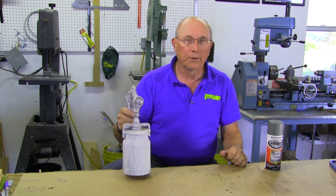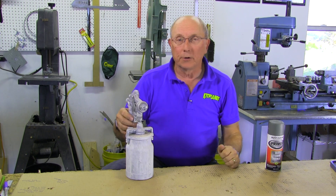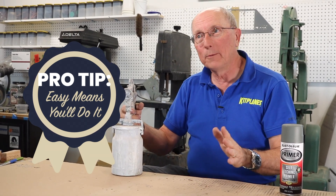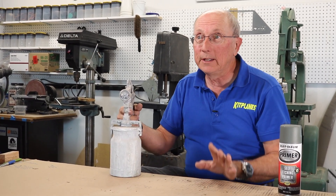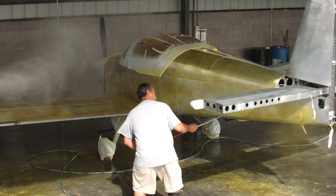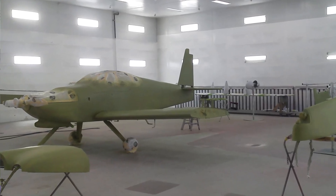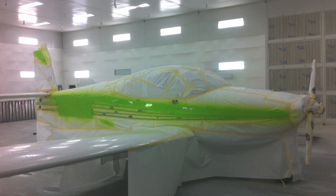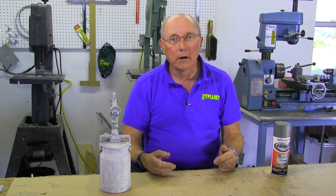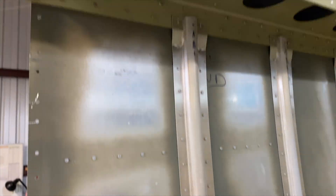The other alternative is to go with a spray-on two-part epoxy type primer. You're going to need spray guns and you're going to need cleanup. I'll admit it — I'm pretty lazy. I really don't like the cleanup of painting; I don't mind spraying it, I find that kind of fun. The standard process for aircraft surface preparation includes cleaning, etching, alodining, priming, and top coating. Each one of those steps takes a lot of work. When you have your airplane painted or you paint your airplane, the exterior is going to go through all of those steps. Remember, that exterior is going to be exposed to the weather, exposed to the sun, out there in the elements all the time, so you want to have a paint that stays on the airplane. On the interior, you're not going to see that same kind of wear, but it's good to have a nice primer layer that's going to stay put if you want to have a primer.